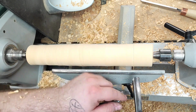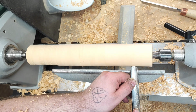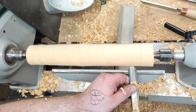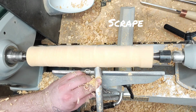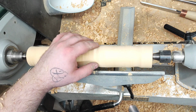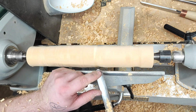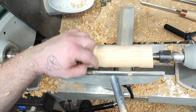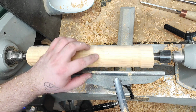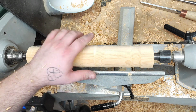The wood will always come down onto the tool. The way you present the tool, if I go straight like this, much like most carbide scrapers act, this is peeling, much like carbide scrapers do. So you're presenting the tool edge 90 degrees to the coming down edge surface of the wood. So this is pretty rough.